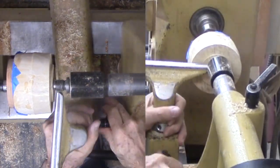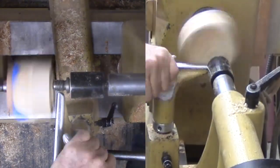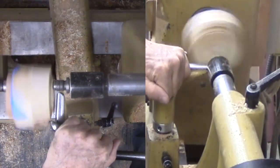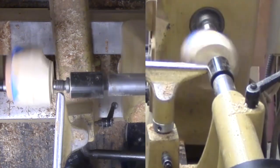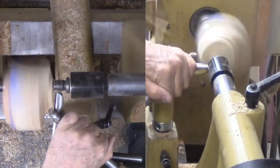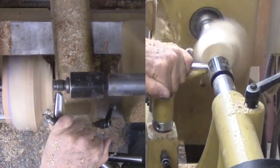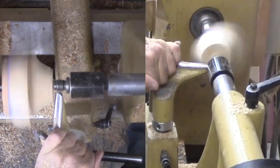I have marked an offset on both top and bottom. With an offset of about an inch, the wood is obviously off center. With my large bowl gouge, I gently start whittling down the wood, cutting mostly air to start with, cutting from the bottom into side grain. My ideal target is a circle at the same level entirely around the base, but I stop a little shy of that because it looks good already.